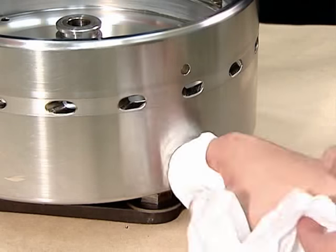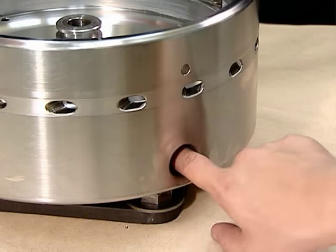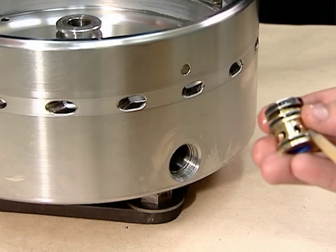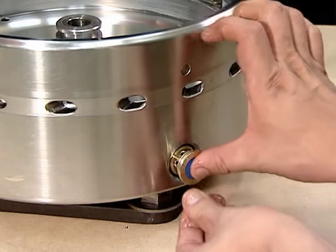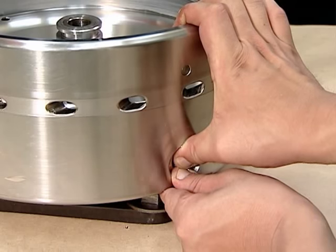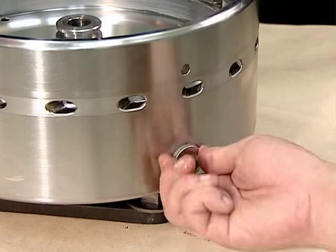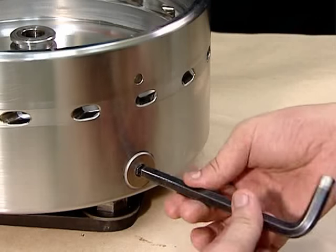Clean the inspection parts of the pilot valves. Lubricate the insertion parts and O-rings of the pilot valves and insert them while lightly pressing on the pilot valves. Take care not to press with excessive force, as this may damage the pilot valves' O-rings. Tighten the valve nuts firmly.